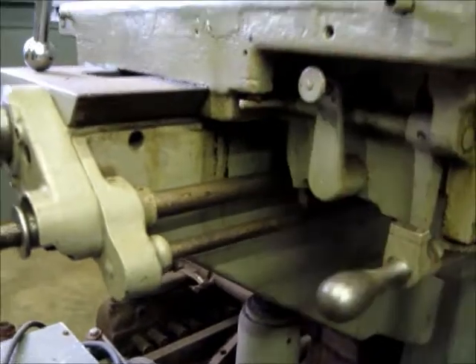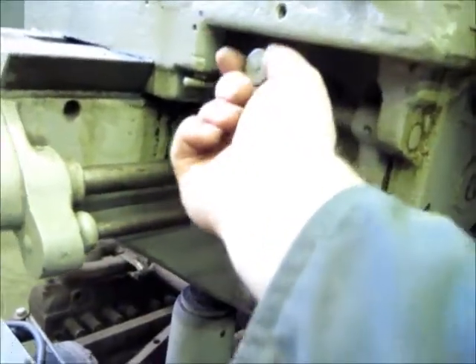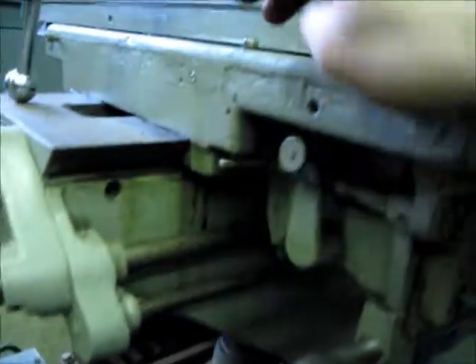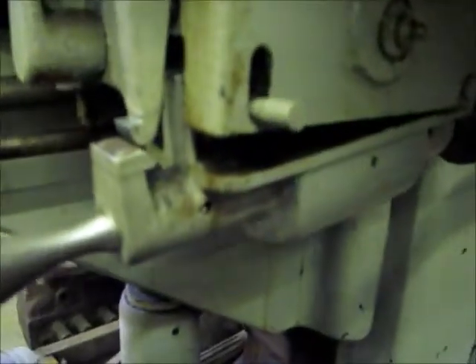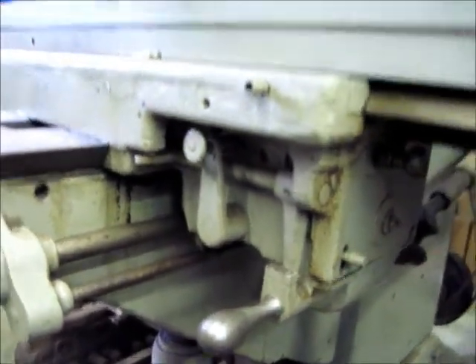When you want to use sideways motion on the table, the gear is disengaged. This is engaged. Then you move this for right travel and left travel. This button up here unlocks the worm gear — that's a quick release to stop the motion. And you just put that back in gear there. So let's start it up.